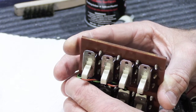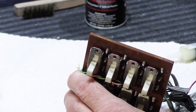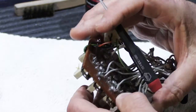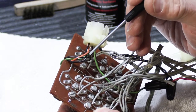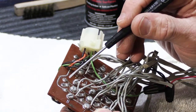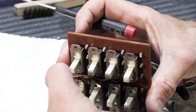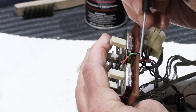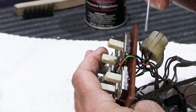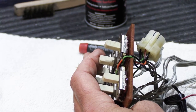The last thing I'll say about this, for those of you who are very handy and think that there's other ways to do this, which perhaps there are, but this is the way I've learned to do it: one of the things that you should never, ever do is remove the switches from the board by desoldering them, so you could pluck it off the board, and then unbend the little tabs that hold the switch together so you can get inside of it and give it a really deep cleaning, because all you're going to do is ruin the switch.